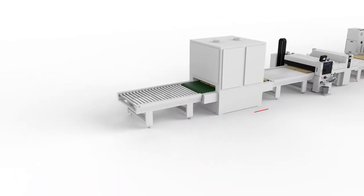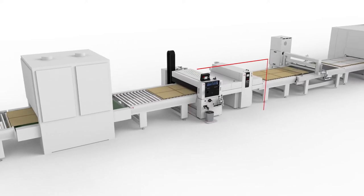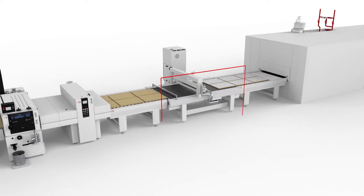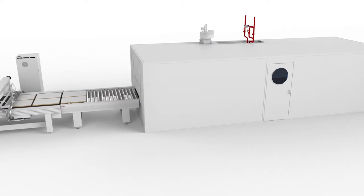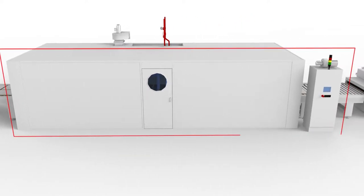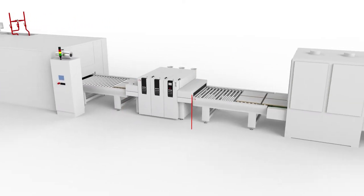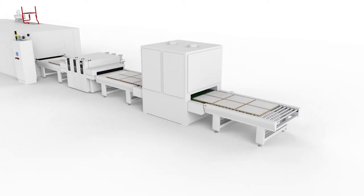The possible makeup of a Smart Vacuum technology line is a relatively compact line whose work cycle includes panel sanding, application of a primer and gelling to promote adhesion, application in a single pass of about 100 to 140 grams per square meter of a 100% UV product, about five to six minutes flash-off for complete setting of the applied primer, drying with a UV oven, and sanding with possible matte or glossy finish by spraying or other application techniques.